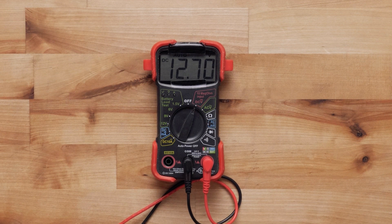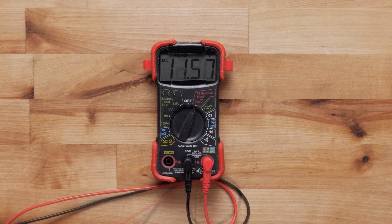The voltage on a fully charged resting battery should be around 12.4 or 12.5 volts. Do not run a voltage test with the motors running or with the battery actively being charged. The battery is likely bad and needs to be replaced or reconditioned if the voltage is below 12 volts on a fully charged battery that has rested for 24 hours after a charge.